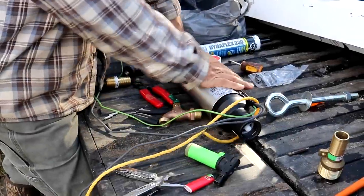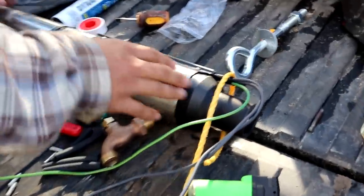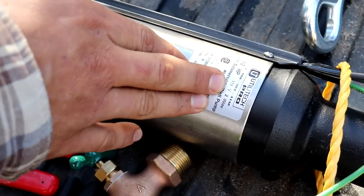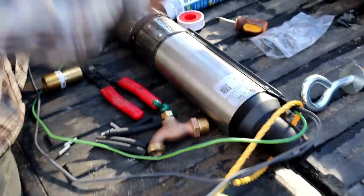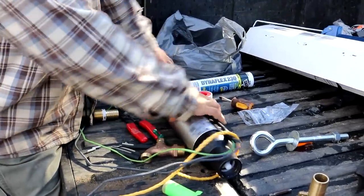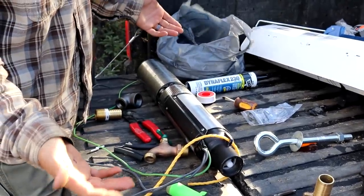So this is the pump we're using and we had to go with a 115 volt pump. This is a submersible pump — it's actually going to go down in the well about 100 feet. We went with the 115 volt because it's going to be a lot easier on our solar system that this is going to be running off of. We're putting this in ourselves to save a little money; it's going to be a lot cheaper than having someone else come out and do it. We've never done this before, but it seems pretty straightforward and we're going to give it a go.